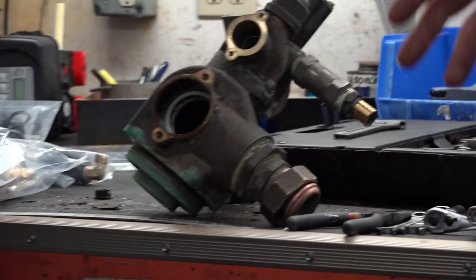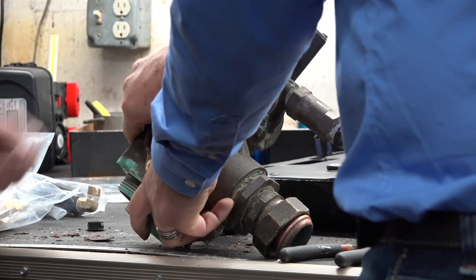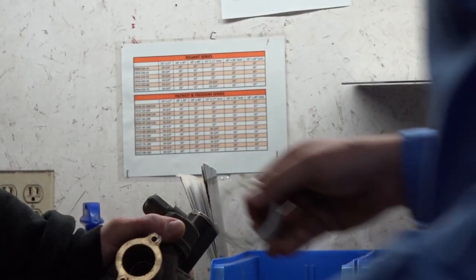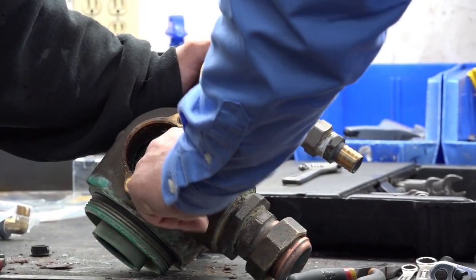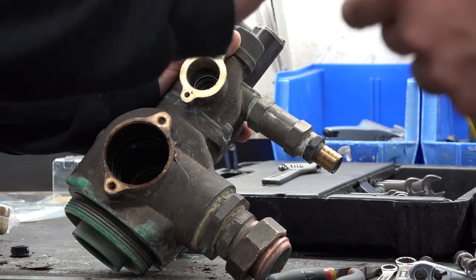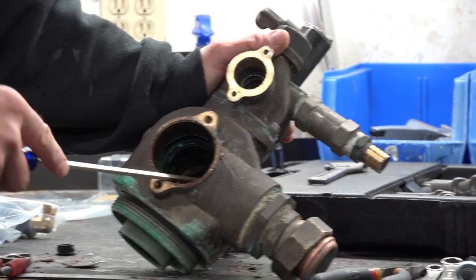Next trick is we need to pull out all these seals and spacers. So in that case, one of the seals actually came out with the piston. Next was a spacer. The next thing in there is a seal, another rubber seal. Nice part about the bottom is you can reach the seals pretty good. It may be necessary to have a flathead screwdriver just to kind of break it loose, to kind of pry against the brass, to just break the seal.